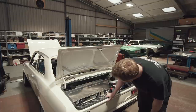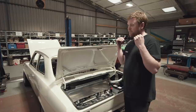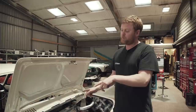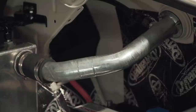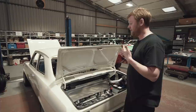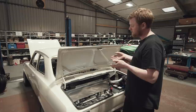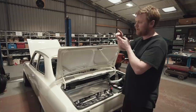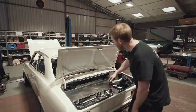The venting on the tank is also relevant to talk about. We've got a dash 6 spigot both sides at the front and a smaller dash 3 both sides. There are two reasons you need to vent the tank. One is as the fuel expands, contracts, or you're actually using the fuel, air needs to go into the tank to take up the space as the fuel level drops — so the small vents are for that in-use venting. The other venting is literally just a filling issue. When you fill the tank, air can come out through the filler neck, but with a forecourt petrol station pump, the air rushing up the neck clicks the pump out. You have loads of problems with the pump clicking out if you don't vent it higher than where the end of the nozzle is, which is why on most older cars you'll see a vent off the side of the filler neck, a little way down from the cap, venting air from the tank out through the filler neck but above the point of the end of the nozzle.